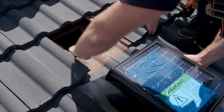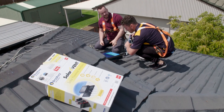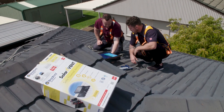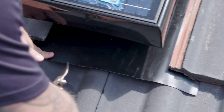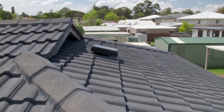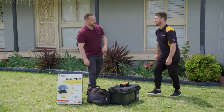Do you want to help me lift up this tile? I'll run a bead of silicone down the outside edges just to seal it up. With this flexible skirt, I'll put a little snip here and here so it molds nicely to the tiles. It's whisper quiet but so powerful — this will be the perfect solution to pull all that hot air out of the roof space. Your job looks so easy! It's kind of like the next step in the evolution of roof ventilation.